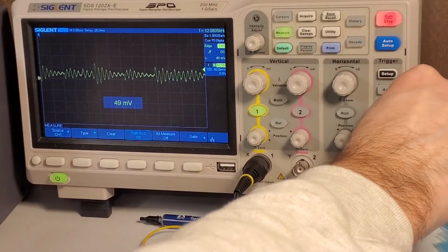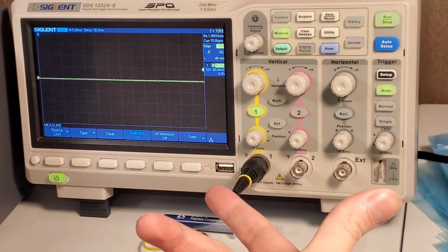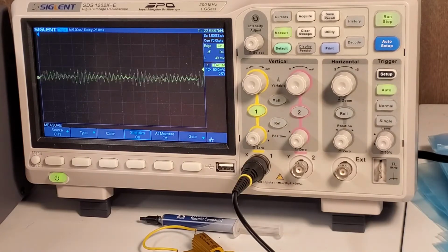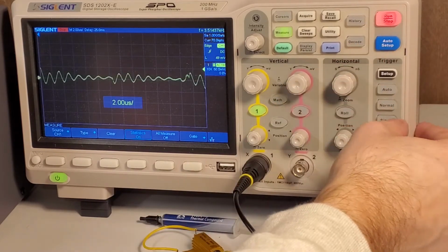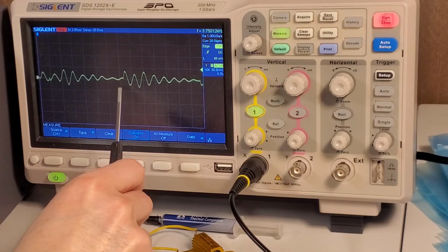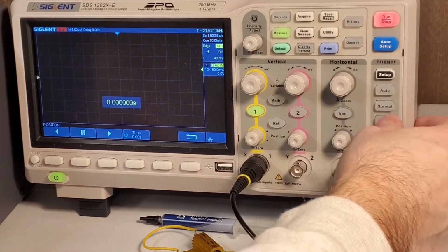Okay. So I don't know if that is switching noise coming from this or not. I guess the way to tell is let's just turn it off and set it to auto. Okay. Quiet when it's off. So that is probably that internal buck converter or whatever the switching control mechanism is we talked through. So let's just single this guy. Let's get a good one where we can see a shift here. So like what you're seeing right there, where you have a dampening out ringing and then that step shift, that's definitely a switching edge. I think I see another switching edge right there if I step out one more. I'm just trying to get a single where we can see a couple of those really nice.